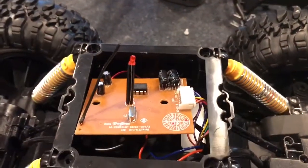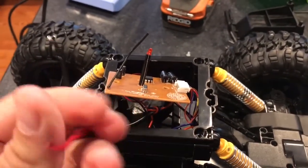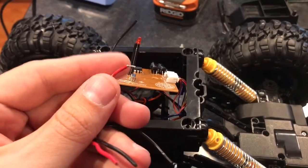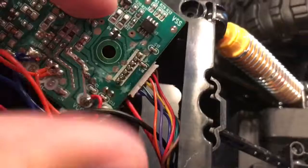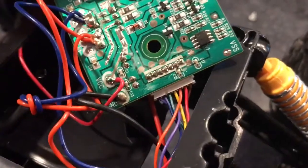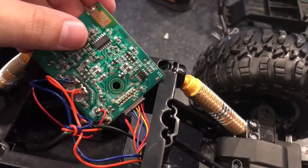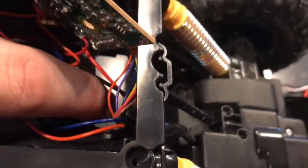The last thing I had to do was solder on the new cable. I took off the original wiring — cut off the end for the plug they had — and then desoldered it from the circuit board: the negative (ground) and the wire going to the power switch. On the circuit board, your ground is in the bottom corner — you can see it actually says 'GND' for ground. That was easy to work with; there was plenty of solder and it only needed a little heat to melt. Then you've got all this new real estate to run your wires through since we ground that bump off.